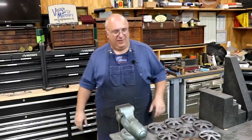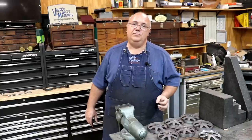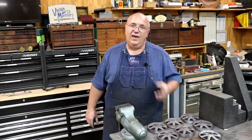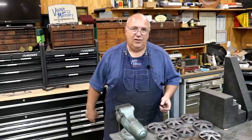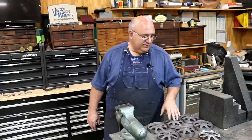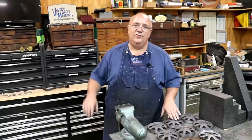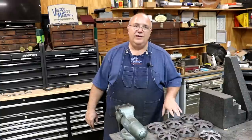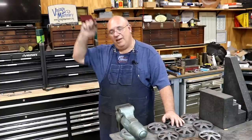Well, there you go, guys — that is going to be a wrap. We got these wheels knocked out. Had to make a little fixture to get it done, but that's just part of it. Sometimes work holding can be the most challenging part of working on something in a machine shop, and you just have to think about what you can do to hold the part. Often that involves making a little fixture — in this case, all scrap material laying around, hardly any cost, just a little bit of time, but it really let us get it done easily. Even in a small production setting like this with six parts, once I got it set up on the first one and got all those zeros set, I could just dial right to everything without even making measurements. As always, thank you so much for watching — please subscribe, thumbs up, comments are greatly appreciated. Hit that bell icon for notifications, and we'll catch you on the next video.